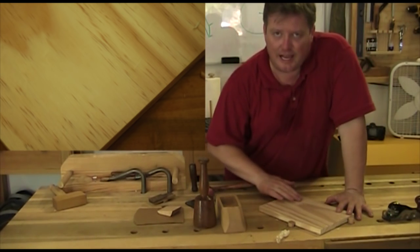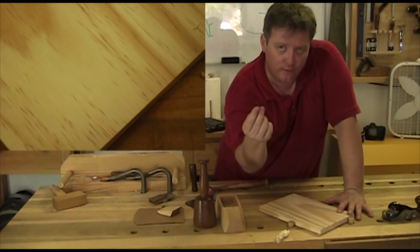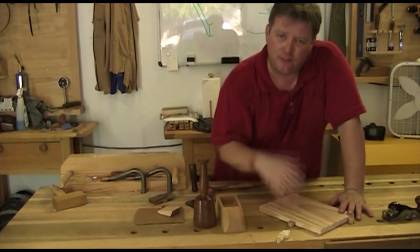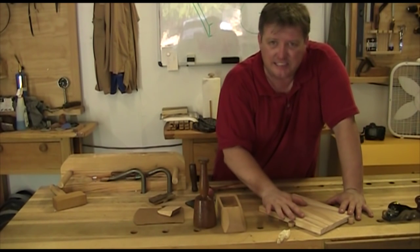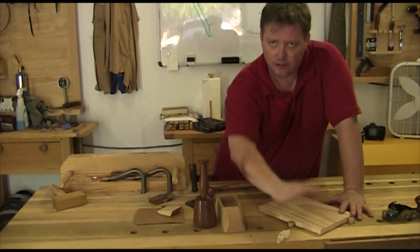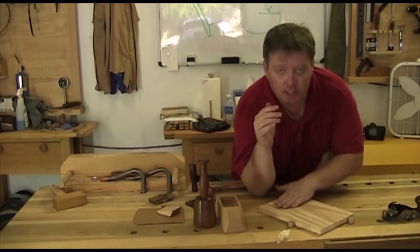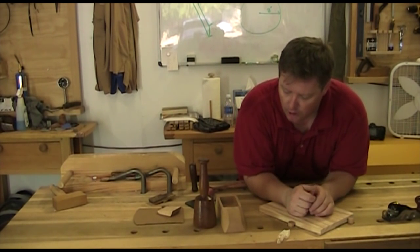Now this is glass smooth, but my fingers can feel that fraction of a thousandth of an inch — we have a really good sense of feel with our fingers. Your customers would not feel that one, so most people would then sand this. But if you don't want to have to sand it — which will raise the grain, meaning you actually have to sand it twice: after you wet it with finish, re-sand it back down, add more finish, maybe hit it again with 400 or 600 for your final finish — if you want to go straight to that final finish, you want a severed fiber, not an abraded fiber. That's where hand planes are really nice.